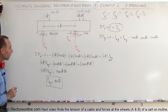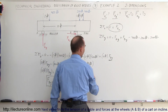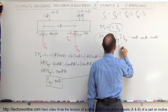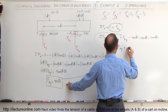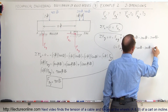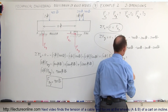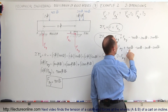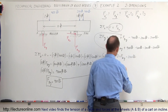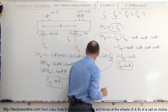Now that FB_y is 900 pounds, we can find FA_y by plugging back into our force equation: 0 = FA_y + 900 − 400 − 200 − 500. Combining those terms gives FA_y − 200 = 0, which means the force at A in the y-direction must equal 200 pounds.